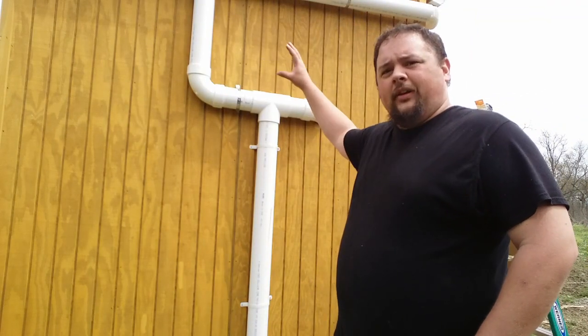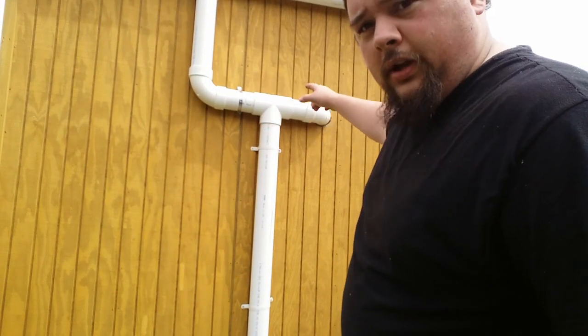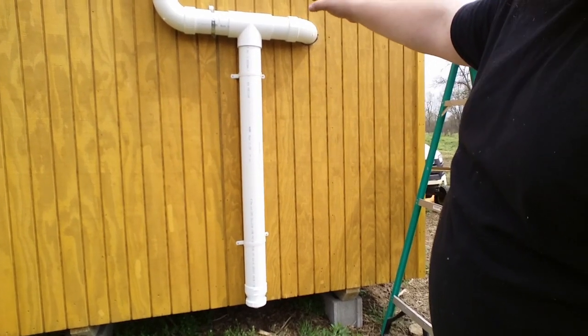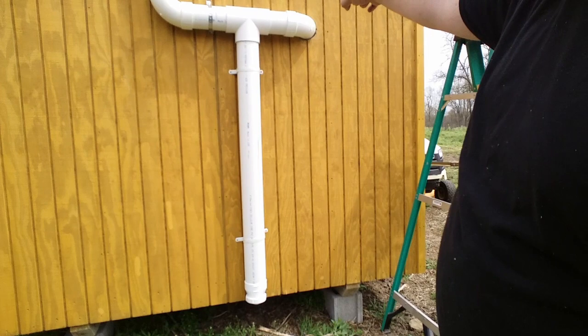And there it is — the outside section is completely finished. I've got it going from the gutters into the T up top where it merges. All the water from my roof goes down into that T, which is my first flush diverter. Once this fills up, that ball is going to slowly float up to the top, block everything — all the gunk gets stuck in this — and the clean water passes right through that T and goes into my tank. So I've got the outside section done, I just need to go inside and take the piping from this into the tank.